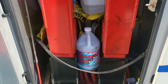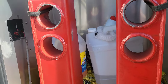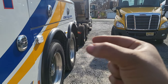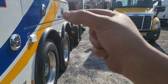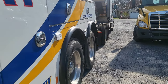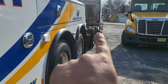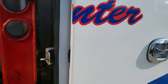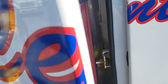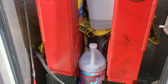In here is a wheel lift. So instead of going by the axle or hooking it up from the fifth wheel like I showed you, there are pieces you can put together that will go around the tires - you kind of cup the tires on each side and you can lift the entire truck by the tires. That's another option you have when trying to tow a vehicle - it's called a wheel lift. If you're towing from the rear you always have to chain up that axle; from the front you don't have to worry because it'll be touching the ground anyway. It's a lot of work though - these pieces are very heavy.